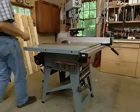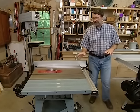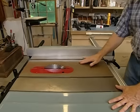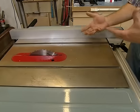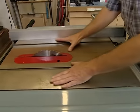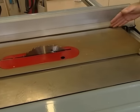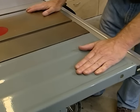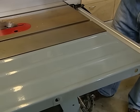The next option is a step up of price and performance. This is known as a contractor saw. We've had this one around for years over in the garage workshop — in fact, it's been neglected a bit; there's some rust on the cast iron table. We're getting into a saw that's a bit heavier, not as easy to move around. However, with this cast iron top, the manufacturer can machine it absolutely flat, and these miter slots can be very accurate. The extensions are pressed steel, which is a trade-off — you don't want to make the saw too heavy, but you want some support for larger pieces.